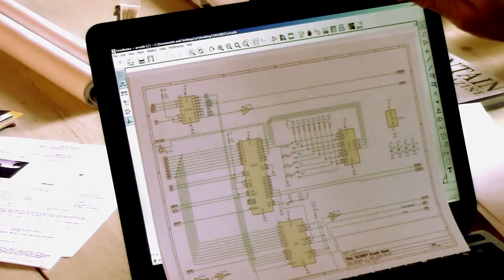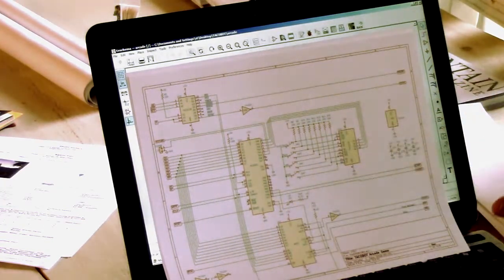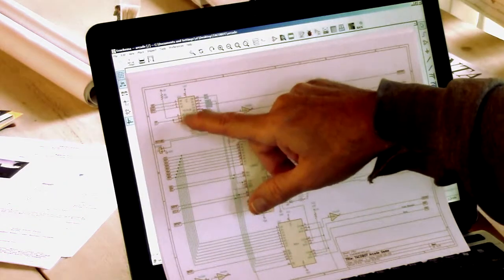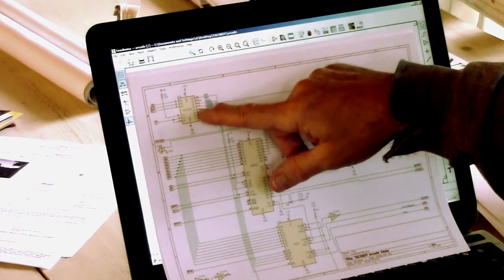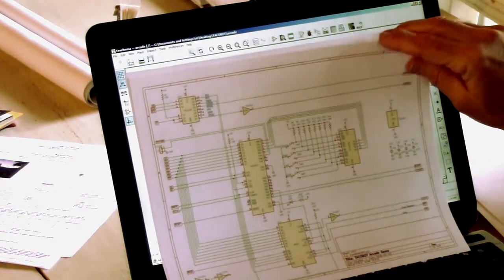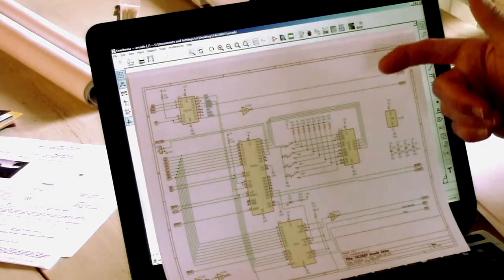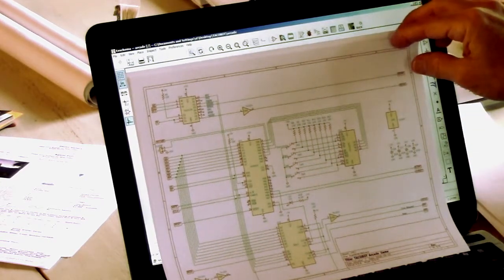I/O, you've got a parallel port and a timer chip here. There's another one of those funny blobs. And then a decoder here. I've allowed for other potential things like a serial port and stuff, but it's not in this design. So we have some push buttons coming in, and the timers will generate the video sync signals.